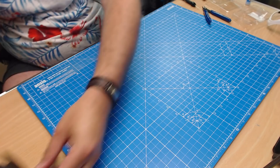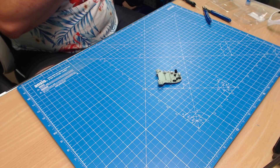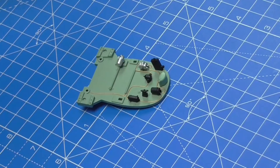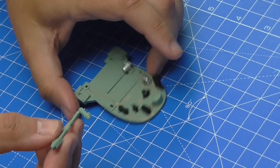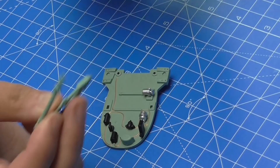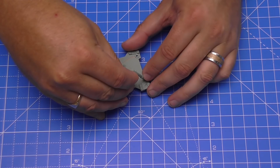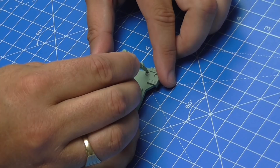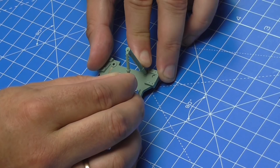I'll put the fuselage to one side and bring over the bulkhead. We're going to attach the brackets we had from issue 11. We've got bracket one and two. The first bracket has a detail on it and is going to go in this way around — flat end and a lug fitting together. I'll put some glue in and get it into place. I'm being quite sparing with the glue here because it's metal going into metal — only superglue is holding it — so make sure they fit flat and straight, as you won't really be able to move them afterwards.